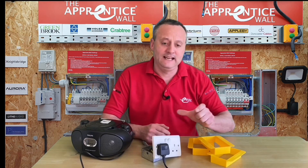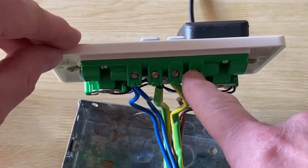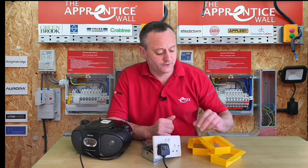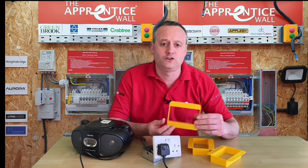I've left that situation before — it escalated with the painter and decorator — but let's review what he was up to. He removed the two front screws out of the socket outlet and lifted it away from the wall, allowing him to paint neatly around the actual socket outlet itself. We know that socket outlet was live because he was listening to his music. That situation is unacceptable. There's a massive risk of electric shock from accessing the terminals in the back of the socket outlet, so that can't be left in situ. There must be a solution to that problem.